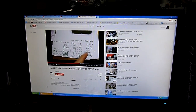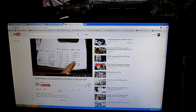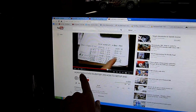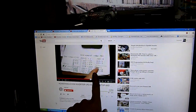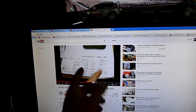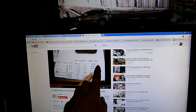G'day folks. I just wanted to report that I've got the cheap VFD working, thanks to accidentally finding a video. DJB HSI has one on a four kilowatt version of the cheap inverters, and he's gone through how he hooked it up to a milling machine motor. Although it's 60 Hz US, I just did the equivalencies for Australia and set the ramp.